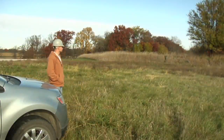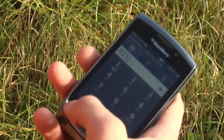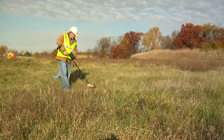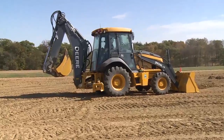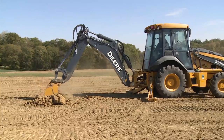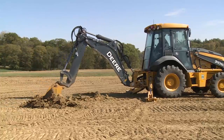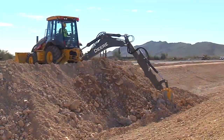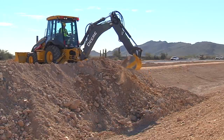To prevent cave-ins near an excavation, work perpendicular to it or at a slight angle to keep extra weight away from the edge. When planning to dig a trench, always call ahead so underground utilities can be located and marked. In the United States, one easy phone call to 811 starts the process to get underground utility lines marked for free — your call will be routed to your local one-call center. When setting up to dig, be sure the stabilizers have a solid base to rest on. Place the spoil pile at least three feet away from the excavation, even farther if the excavation is deep or in loose soil. When digging on a slope, place the soil pile on the upper side of the trench — the machine is more stable when swinging uphill and it makes it easier to backfill.